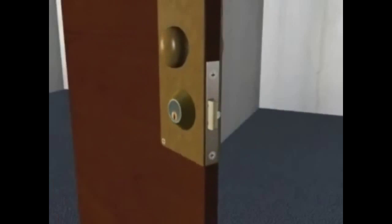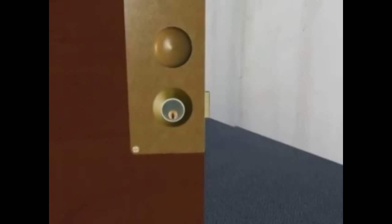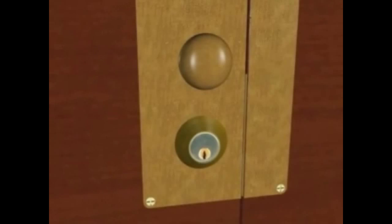Many sophisticated doorknob assemblies used in commercial applications are not susceptible to this. They have additional protrusions that stick out of the door. This anti-pick latch is pushed into the door when the door is closed. The mechanism then mechanically prevents the main latch from being pushed back into the door without opening the lock.